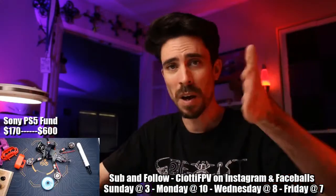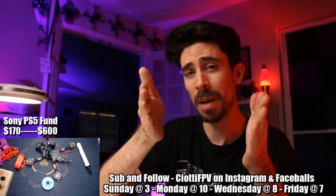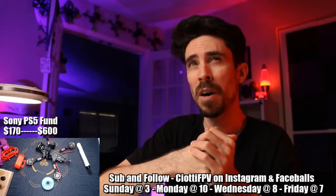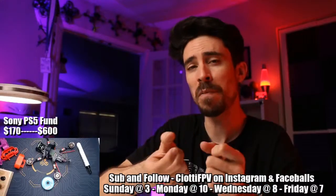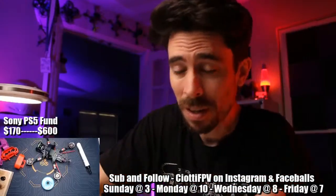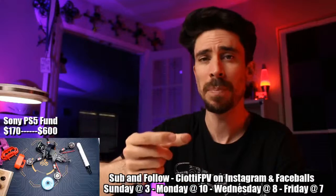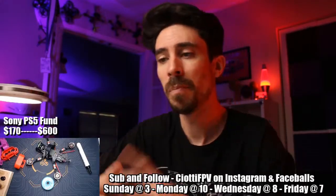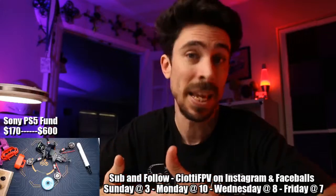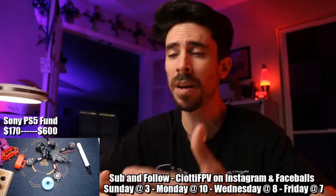So RunCam Thumb is kind of like the bottom basically, and then a pretty big step up from that is the RunCam Hybrid, which is basically a 13 gram solution, so it's not much heavier than the thumb. The thumb, I think, is what, 8 grams? And then you've got a separate FPV cam, which is another like 3 or 4 grams, and then the mount for the thumb. So it's probably no increase in weight to go from an external thumb and a separate FPV cam to the RunCam Hybrid. But just for the sake of this conversation, the RunCam Hybrid is basically a 13 gram payload that you're carrying around in extra weight for that HD camera.